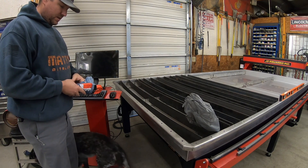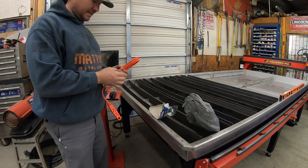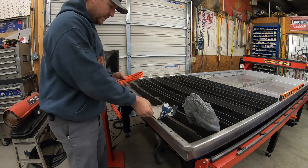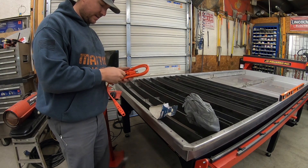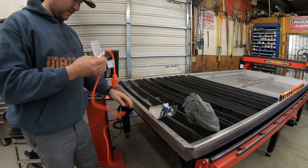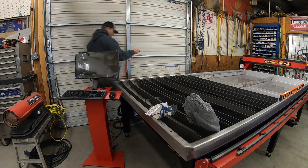To start with, I'm still going to use my Torchmate CAD from our old Torchmate table. We'll use that for now and export it to SheetCAM as a DXF, which converts it to G-code so the MAD table knows what to cut, then load it up in the cut software. Just a little learning curve, but I've got a couple of jobs this week I need to get out quickly, so I don't have time to mess with learning it from scratch right now.